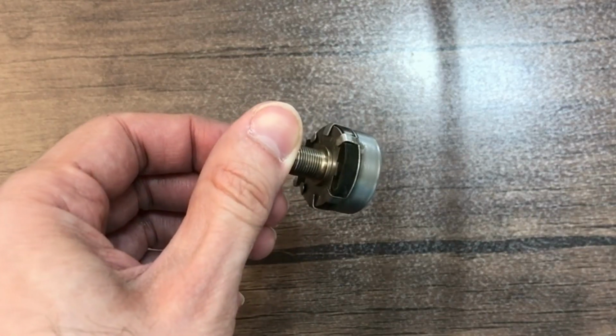And there are also some kinds of potentiometers with the same problem of scratching noise, but they are perfectly isolated from the outside. But they have the same problem. Because of that, I don't believe that dirt can be the most important culprit for this problem. So, if that's the case, we can have another, very specific solution to eliminate this scratching noise for a very long time. So first, in practice, I will show you how to reach that carbon track and also how to repair it.